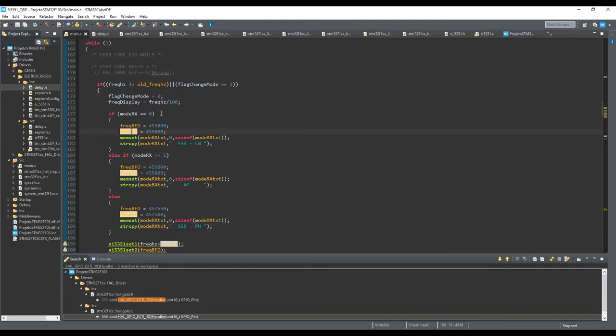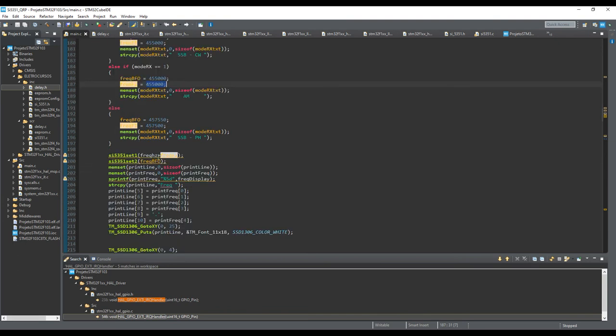So this is why, look at that, so interesting. The BFO, as I already explained in the circuit, for the CW is 455.8 kHz. Remember the 800 Hz, which is responsible for making my reception tone of the CW? It's here. The intermediate frequency is actually centered at 455. For amplitude modulation, 455 BFO, 455 intermediate frequency. And for SSB phone, I set it in the middle of my filter bandwidth, which I explained.